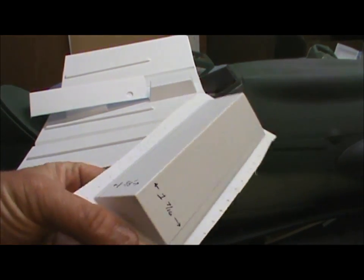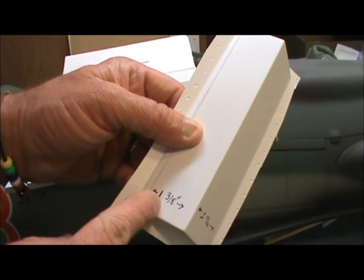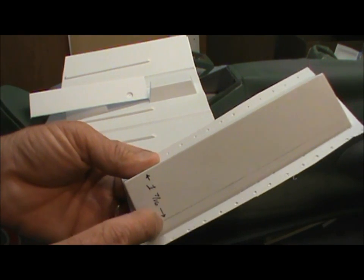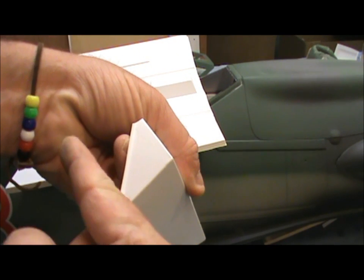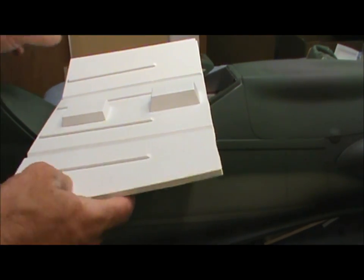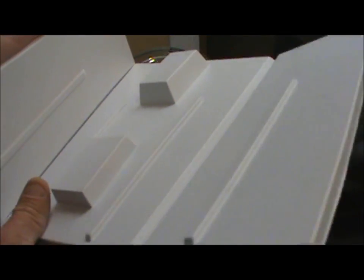On the top — which is a little shorter than the side — we'll come back from this corner one and three-eighths inches and draw a line all the way across. Then from this corner down the side we're going one and seven-sixteenths inches and drawing a line straight out. Once we've got that done, we cut the piece out — cut along the line, then cut straight back — and that'll give you the clearance you need to glue it on. You can leave the diagonal for a little bit of strength. To glue these in, use pliers to fold and crimp it all the way across.